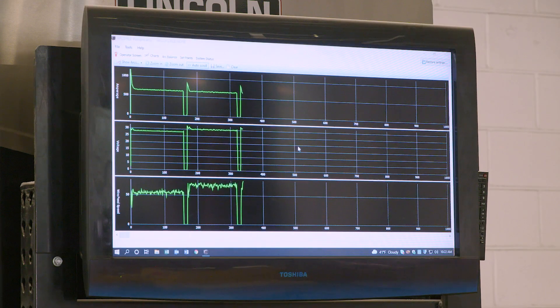Back in Command Center, looking at our third weld on the right, we have the same 650 amps and the same 30 volts as our second weld, with a slightly higher wire feed speed. On this third weld we had approximately 1.9 meters per minute wire feed speed — a 12 percent increase over the 1.72 we saw on our second weld and a 34 percent increase over our first weld. Note that there is slightly lower penetration when using these settings due to increased time spent in DC negative, but there's still a very low risk for lack of fusion.